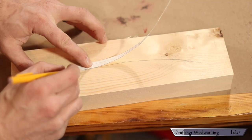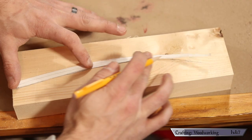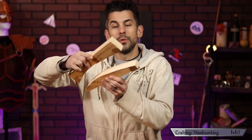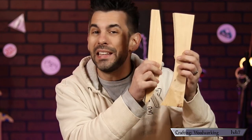To do this I took a piece of pine I had laying around and drew in the shape of the stem, then I cut along my line with the jigsaw. So once we glue up the two pieces of our stem we can use this as a clamp and clamp it into place, so it takes on this shape. Once the glue dries and we release it from the clamp it should maintain that shape.